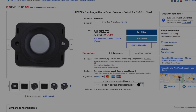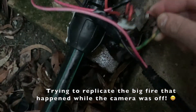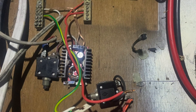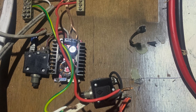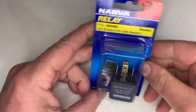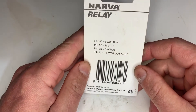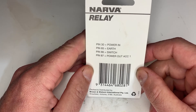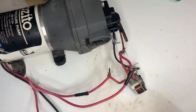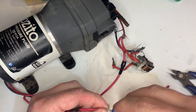In reality a sturdy relay is all it's needed. This was a headlight relay out of a Mazda Tribute or Ford Explorer. Eventually with all that contact arcing it'll give up the ghost. With the circuit breaker here you can see the DC converter that powers all the downlights in my house — the missing one was supposed to power the pump. I couldn't find a 24 volt relay at my local auto parts store; it's more of a truck thing. It's just a standard headlight relay — the good thing about a name-brand product is it'll do as it says on the label. This time I'm going to do it properly and put spade connectors on.